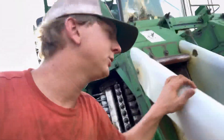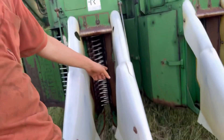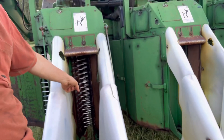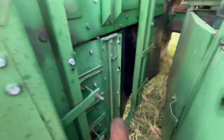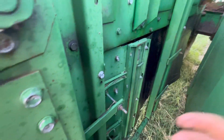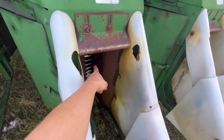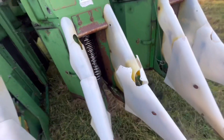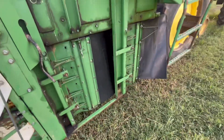Your chutes on the side — I don't know the technical term — the stalk goes in here and goes around the spindles. That's what that plastic is for. This is the back side of that door — it's spring loaded, you can see the springs on it. These bolts adjust it. What you want is about three to five millimeters of clearance between the end of those spindles and that wall, because if you don't have it some of the cotton will slip around. I'm going to check the doffer clearance; if I find any that's out I'll show you how to adjust them, but I don't feel like any of these are out.